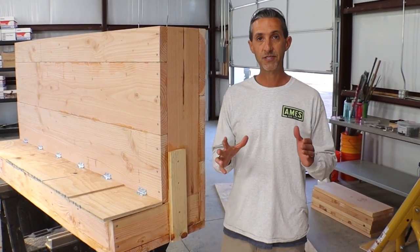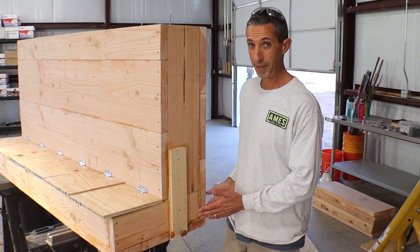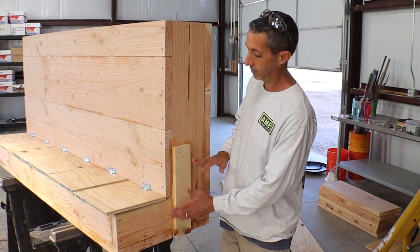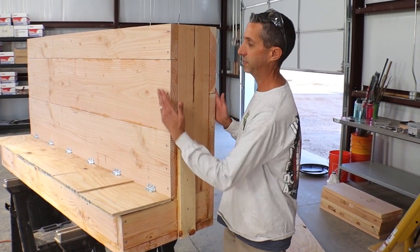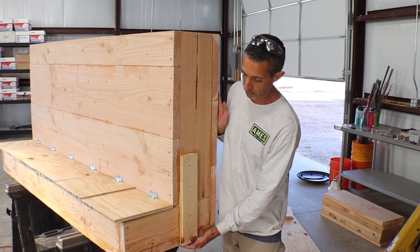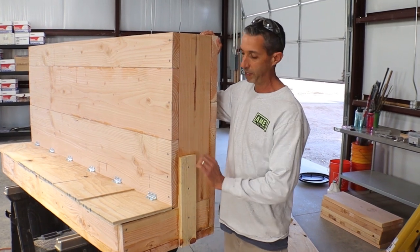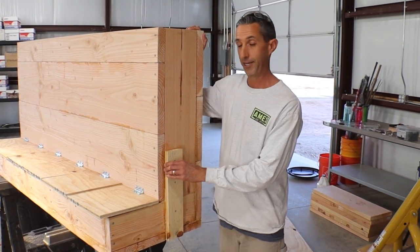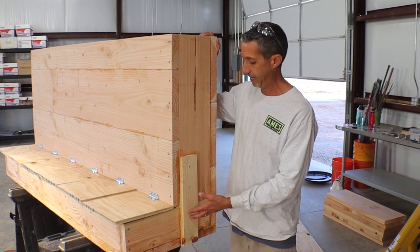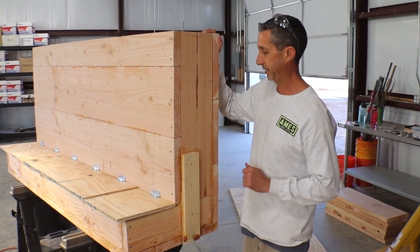One of the things that I didn't consider when I was drawing out the plans was how this piece here attaches to the base. The way we had it originally, the only attachments were basically along the back, and we wanted to make sure that we had another attachment of the front of this top half to the bottom. So I used a basic 1x4 and attached it in a couple different spots here as well as in the upright to make sure that this is not gonna sway back and forth this way. So you need to add that to your supply list unless you can figure out something else. I suppose you could probably use some type of metal bracket like a Simpson tie or something like that. You would be able to attach that as well. It might actually be a little bit cleaner. However, when we're done painting, it won't make a difference for us.